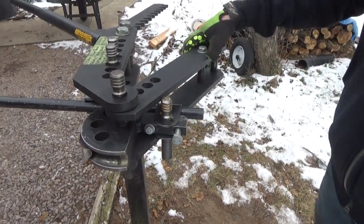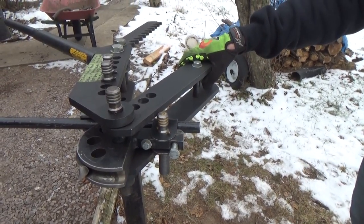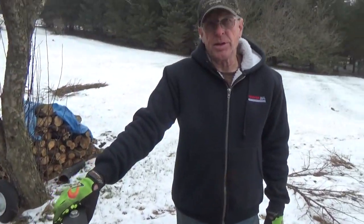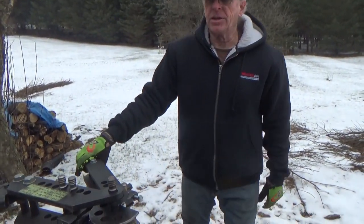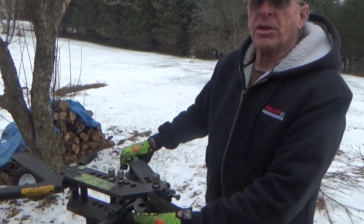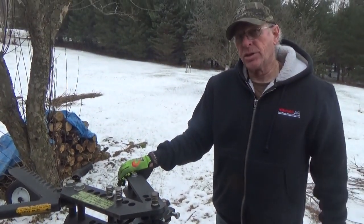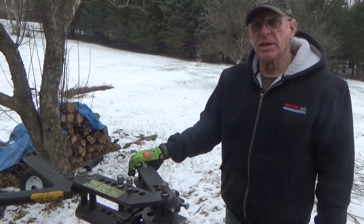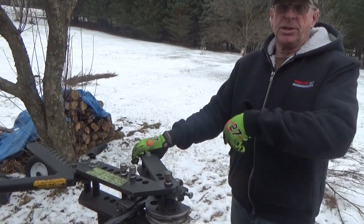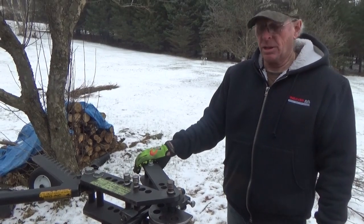If you go to one of our go-kart videos, you'll notice we just got through building some Invader go-karts. Those invader go-karts are inch-and-an-eighth tubing, and I don't have an inch-and-an-eighth die - I have an inch-and-a-quarter die. So I did the same thing for the inch-and-a-quarter die and bent all those carts on inch-and-an-eighth tubing using that spacer, which is sixty-two thousandth material. That takes up a sixteenth of an inch on each side, bringing me down to inch-and-an-eighth, so I can bend that tubing perfectly.